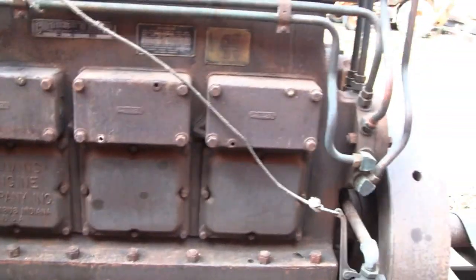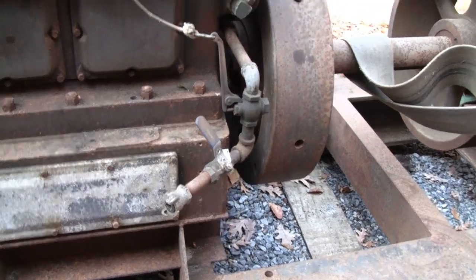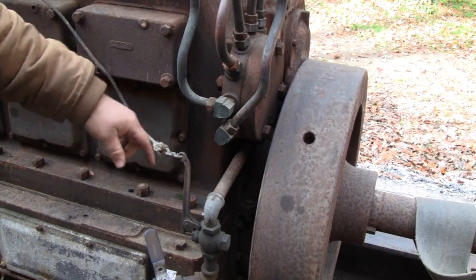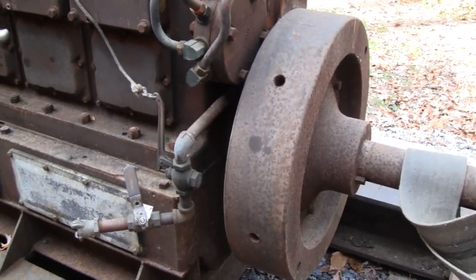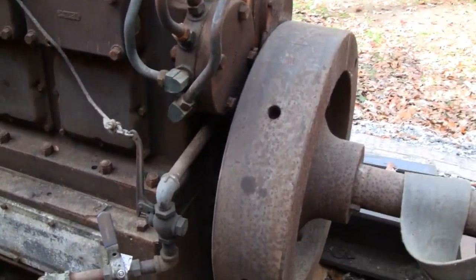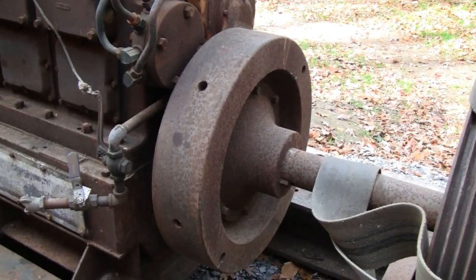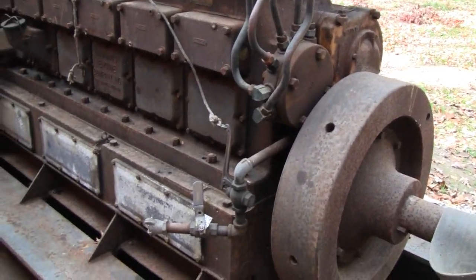So another cool thing is this is air start. Oh yeah, look, it's funny. I was just looking at that, and you mentioned that. Yep. So on the back here, it's got a Chicago fitting and a little whistle valve, pretty much. And then there's an air distributor off the back here. I don't know if you have to rotate this engine to a particular point before you start it, or if, because it's got a distributor running to each cylinder, you can just do it at any position. I was just going to ask you that, because I see the holes and I know they usually bring that around to whatever. The flywheel's got all the marks on it for when you time it, but I don't know if it has to be at a certain start position. We do have the manual for it, all the paperwork, so we'll figure it out.